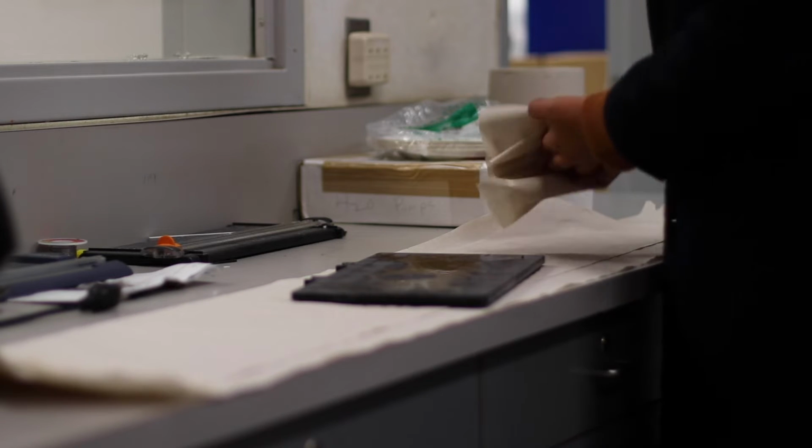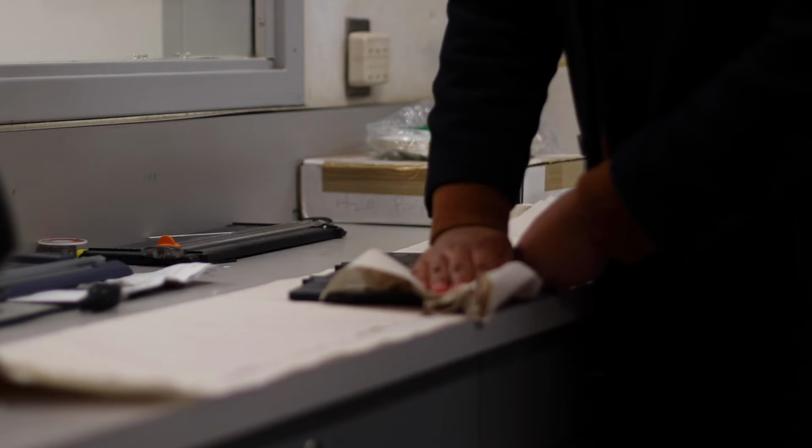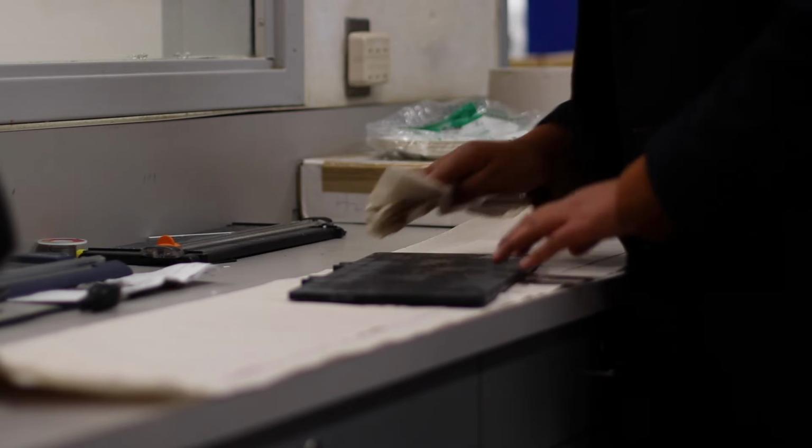After it's been washed, dry the bed with paper towels while only patting it dry. Patting it dry ensures that paper won't fall off onto the bed and stick on it when the glue is added. This can create globs and ruin the part accuracy.